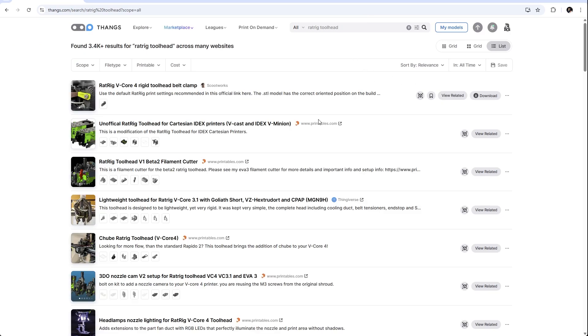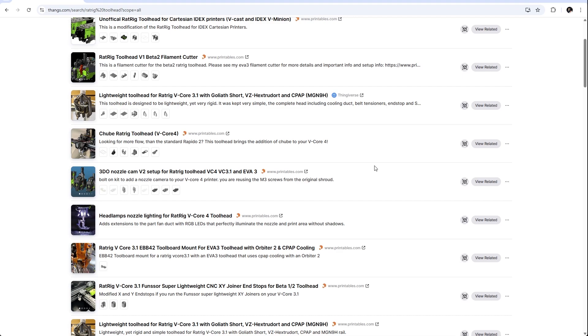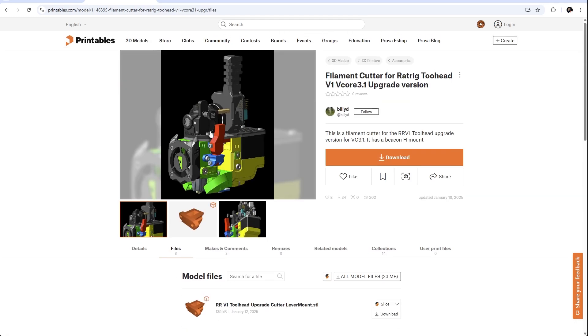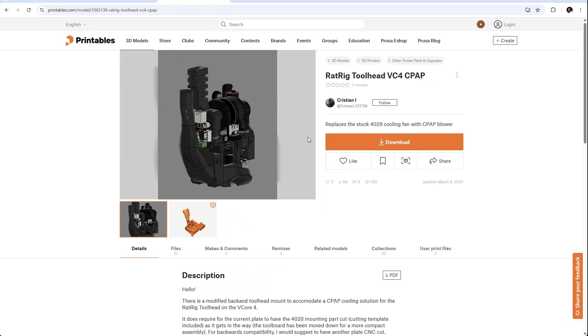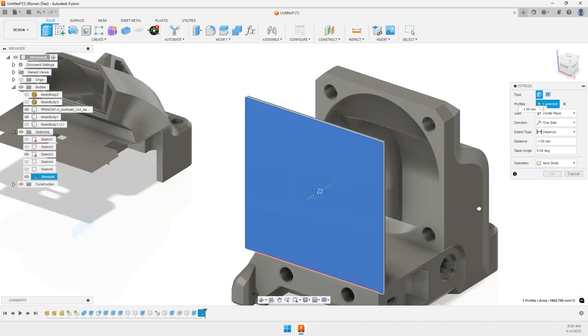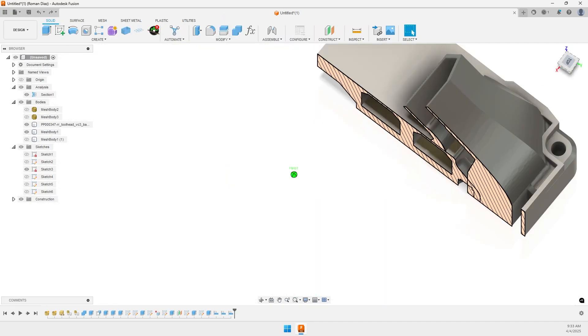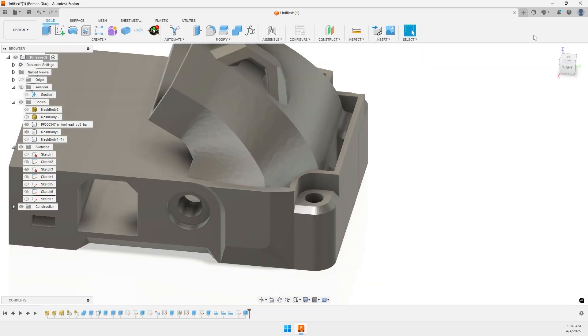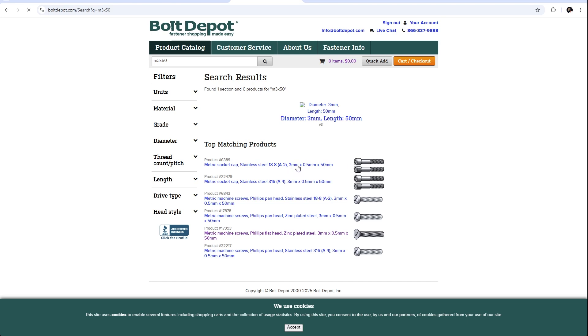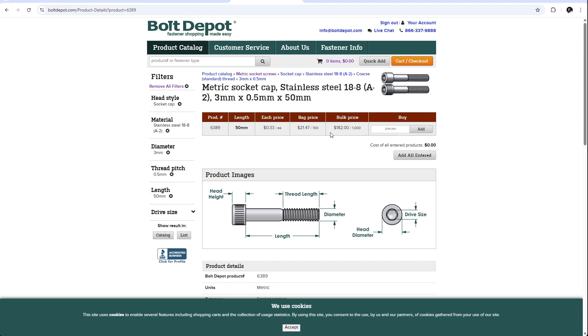The biggest snag is my requirements: I have a V Core 3, want to use CPAP for part cooling, and want to add a filament cutter and sensor at the tool head for potential future upgrades — I'm looking at you, Box Turtle. After some quick searches I found all the models I needed, though I had to do a little surgery to join the CPAP tube since it was designed for the V Core 4 which has a slightly different belt position. For hardware I used Bolt Depot — everything I needed, great prices. Not sponsored, but it's just nice to be able to get a single grub screw if you only need one, delivered cheap and fast.